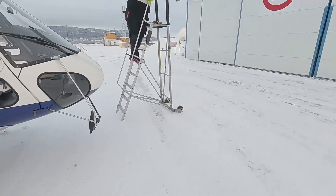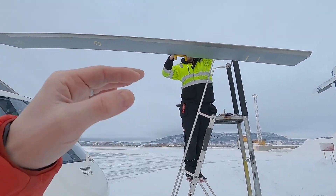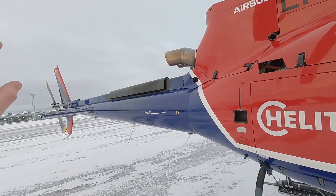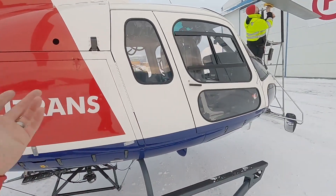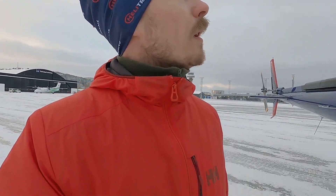We're doing the tabs now. We had a little vertical vibration on the main rotor, so we're doing a tab on that to see if we can get rid of it. It's always interesting when you do these kinds of things because this helicopter has been out of 600 hours — meaning complete gearbox, engine, tail gearbox, everything removed, all the bits and bolts.